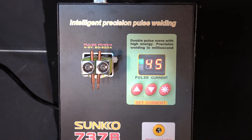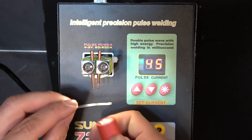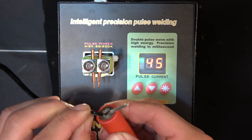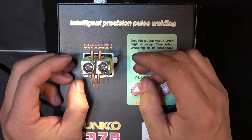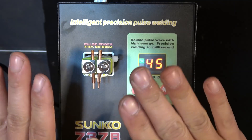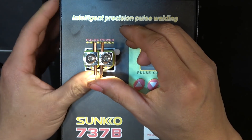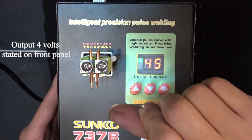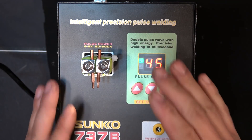There's one thing I need to mention: you've seen me holding these metal strips and activating the switch with very high current — high enough to melt nickel — and I didn't get shocked. Let me demonstrate how safe this is. Just don't try this. I'm going to push the electrode up with my finger — see that? It doesn't weld my hand because my hand is dry. But if your finger is wet, it's going to be a different story. Again, don't try this — it's very dangerous.